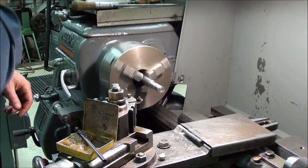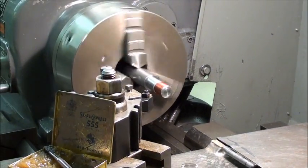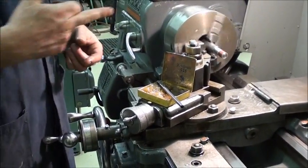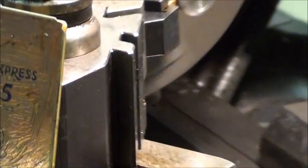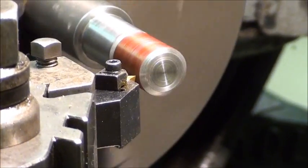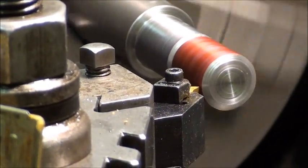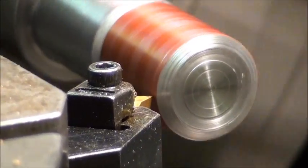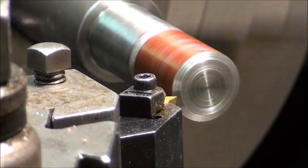Start it up. I'm already set at zero here. I move it forward a little bit — that way I know I'm moving in the positive direction. Bring this in until... there. I've got the shine — see it? And that's why I put that on there, so I know right when I touch. Now I can zero. It should just fall in slightly before.